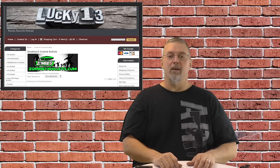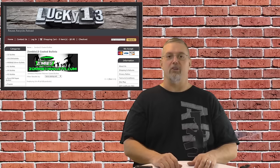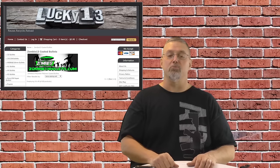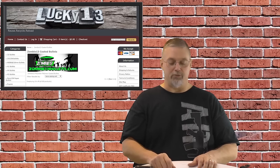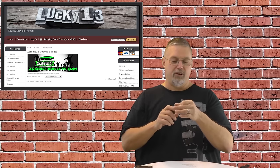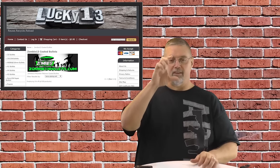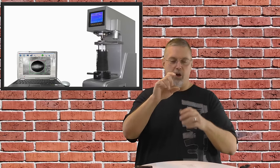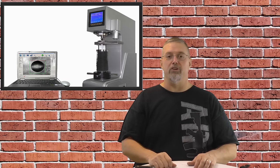Let's talk about how much harder. The way they measure hardness on projectiles is using something called the Brinell Scale. That was thought up by a Swedish engineer named Johan August Brinell back in 1900. What this basically does — they use what almost looks like a drill press, and they take whatever their medium is, a bullet in our case, and they've got a pin coming off that thing with a rounded point on the end. They give a known pressure on the material they're testing, and it leaves an indentation on the material. Then they can measure that indentation and compare one to another. Brinell thought up a scale that would allow you to steadily measure different kinds of material.